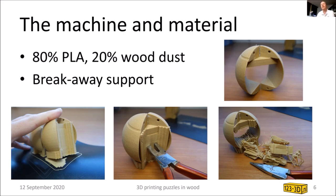The breakaway support goes layer by layer. Once everything is ready, you use tools to remove the support material. The thick parts feel like wood, but the support material, being only a single layer, handles like cardboard — you can pull it with tools, peel it away, or cut it with a knife. You're left with some debris, but ultimately the pieces come out very clean. That's one of the things I really like about this material.